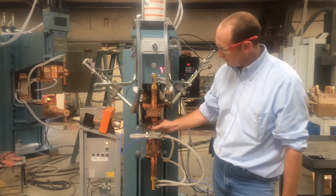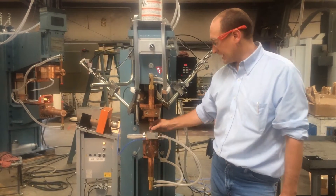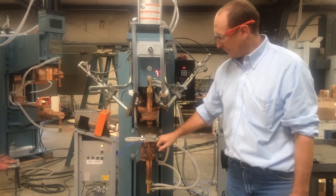You'll notice you can probably hear some air leakage. That's actually a blow-through that's coming through the electrode to keep slag and everything from binding up this lower spring-loaded guide pin. And then this is the water cooling for cooling the outside.